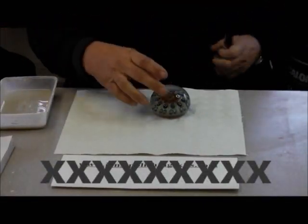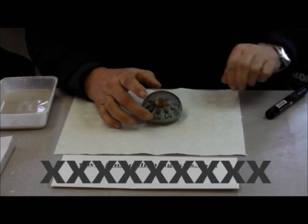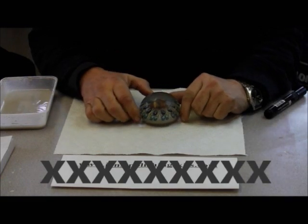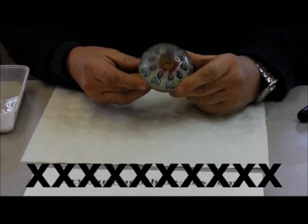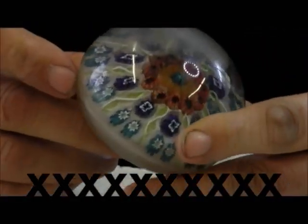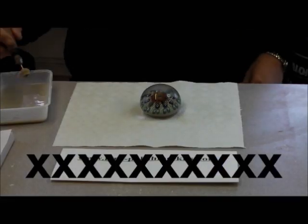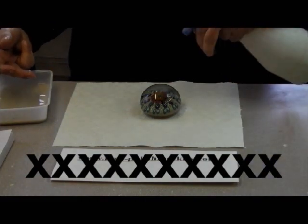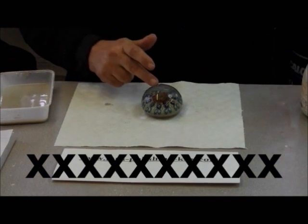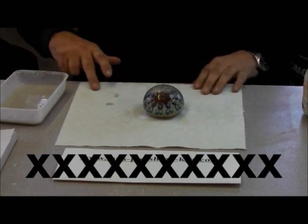The weight has now been ground with the 600 grit, and as you can see the chip has gone. It's in good shape still — actually a good shape, not just fairly good. We're going to go on to the coarse polishing powder now, which is going to start the polishing process — exactly the same as we did before. It's just purely a case of water and polishing powder — let's go.